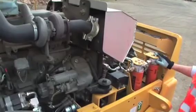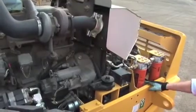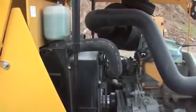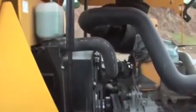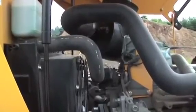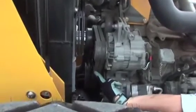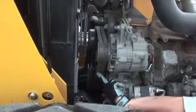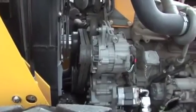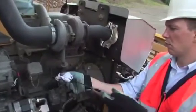Make sure there is no oil leak on the left side engine and pumps. Check the coolant level and air cleaner indicator. If you see the red mark on the indicator, please clean or replace the air filter. Check belt tension and oil level by dipstick. Change engine oil and oil filter every 250 working hours.